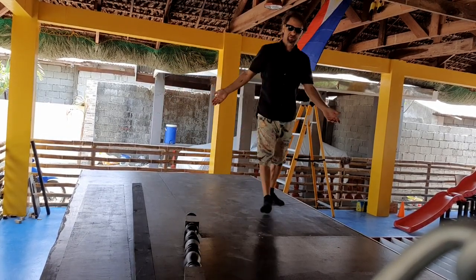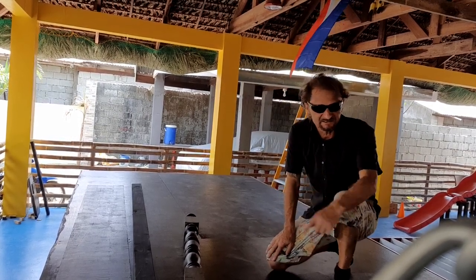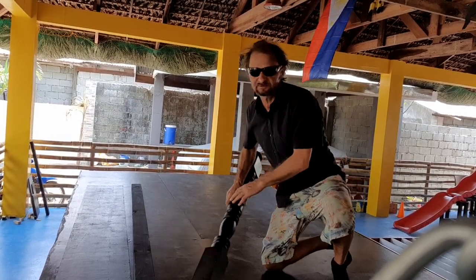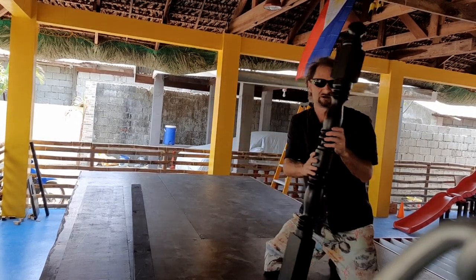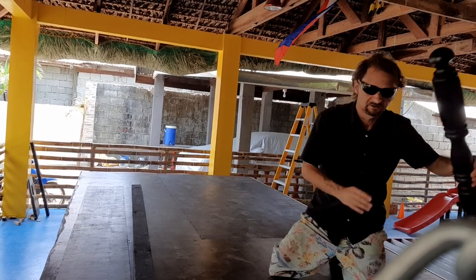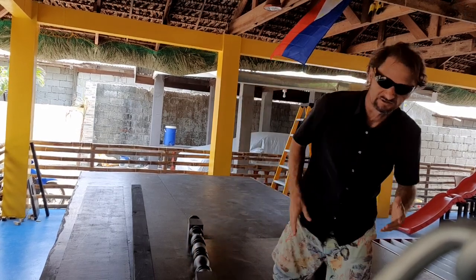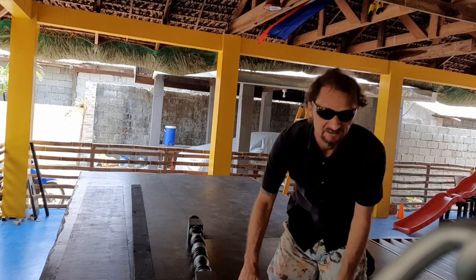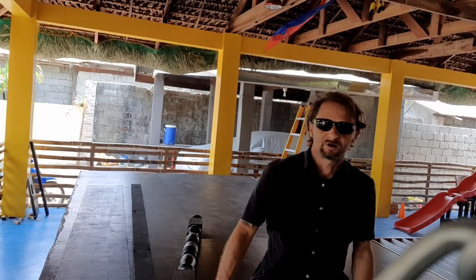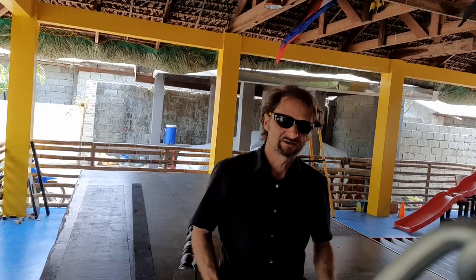So we have our nice big deck up here on both sides of the ramp. On this side, it's 7 feet wide and 12 feet long. The next step is we've got 4 of these balusters here. We're gonna affix one to each corner and then get some nice sturdy railing all around, with some 2x4s coming up vertically, bolted into the ramp so that it's really secure. Because a deck of this size could easily hold a dozen people. And if some of them are heavy set, you're talking 1 ton worth of weight here. We just wanna make sure the railing's nice and secure.